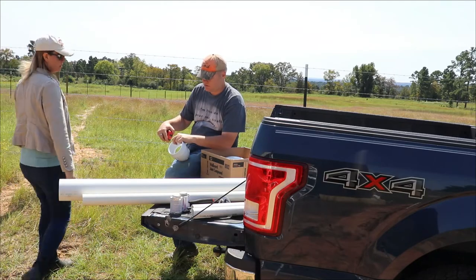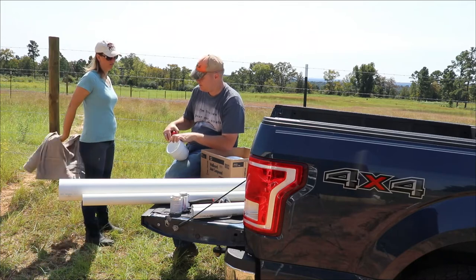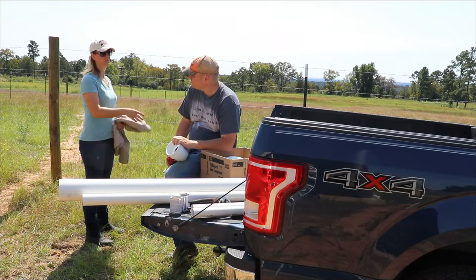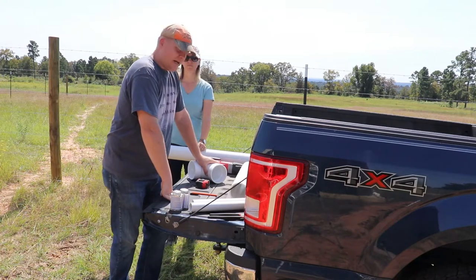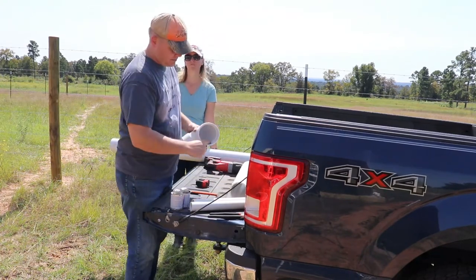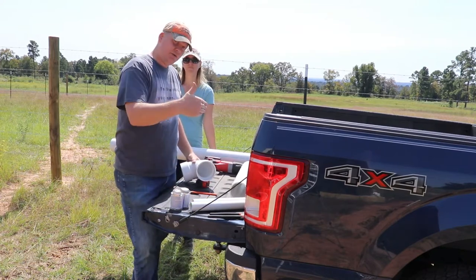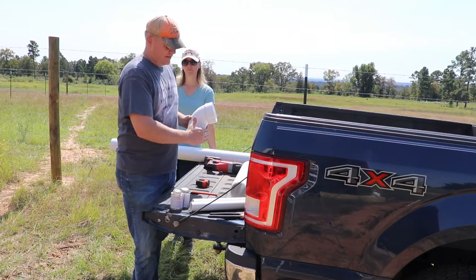If I take off 1.5 inches, that'd be 10 inches, so then it's 10 inches from inside here, inside there. So pipe math kind of bothers me. You can measure it from the inside, you can measure it from the outside, and then when you get to your other corner, did you measure to the inside or the outside? And then there's this offset distance.